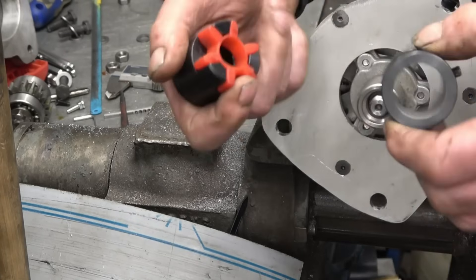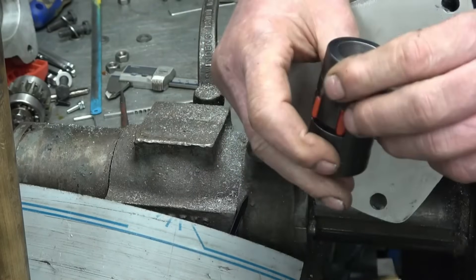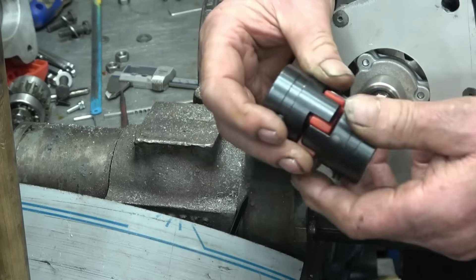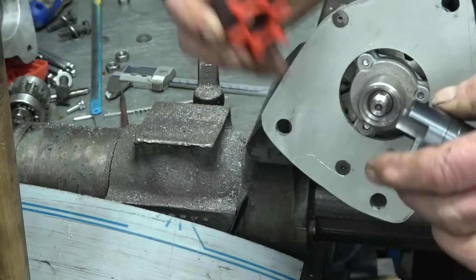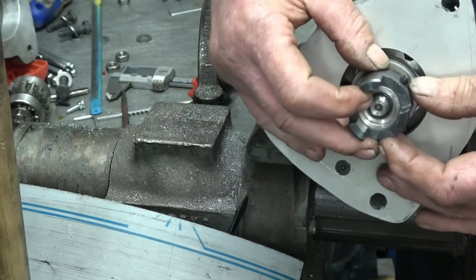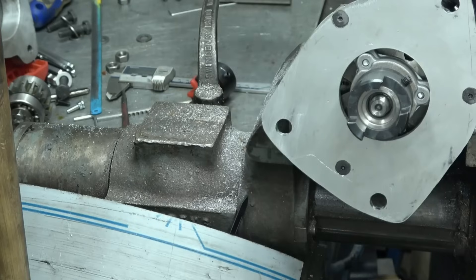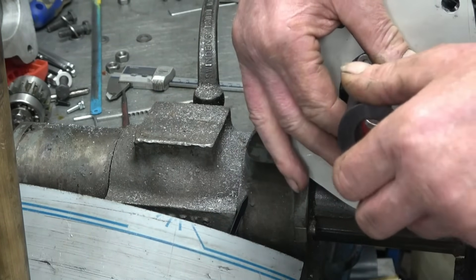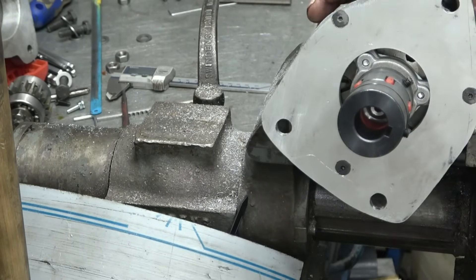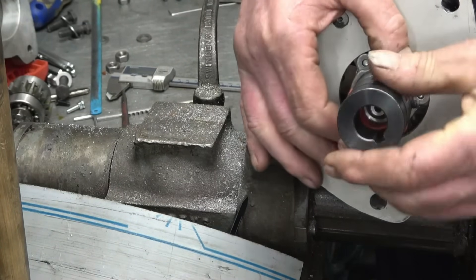I've also bought a cush drive coupling — it's what you use on stepper motors on big CNC machines. It should do the job quite nicely. It comes with a 19mm bore; I've bought it a little bigger to fit on there. That's going to go onto there, probably held on with two grub screws. And that part goes into there and it'll allow for any slight misalignment. So that's this side — I still got the other side to sort out.